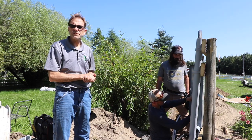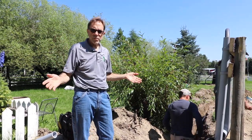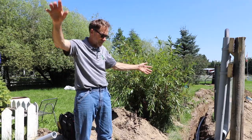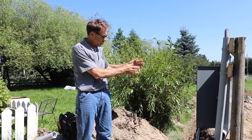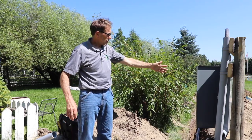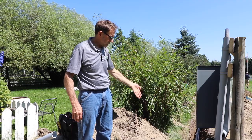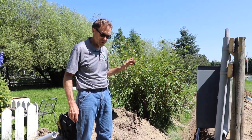We're on day three of our solar install at the Avis farm. To ensure that Rob and his family can expand their renewable energy systems in the future as well as their farm operations, we've upgraded the entire service. This is the new main panel for the site. The big wire coming out here goes back to the original power utility pole. To prove the sizing of the sub-panel for the solar array, he could put up twice as much solar with the existing wiring we put in. By the time you dig the trench and put in the conduit and upgrade everything else, you better run the bigger wire once and size everything for future growth.